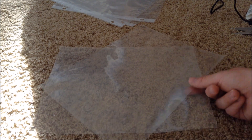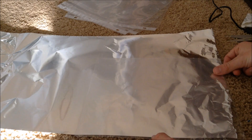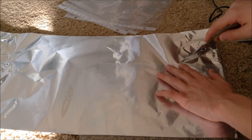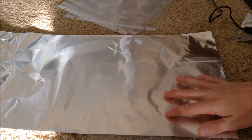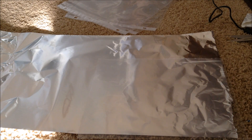Now it's time to prepare the aluminum foil. To do this, take a long sheet of aluminum foil, place your page protector on top of it, and use a knife to cut out the part of the aluminum foil that you will need to make the capacitor. The page protector should overlap the aluminum foil by about one centimeter on each side.